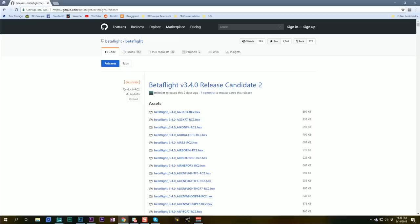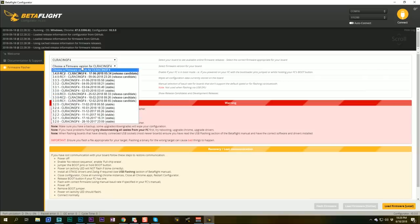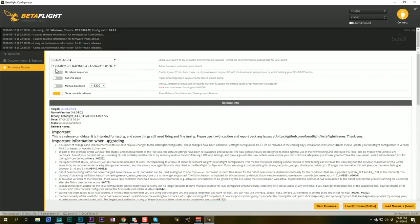The first thing you're going to need is BetaFlight 3.4. At the time of this video it is in release candidate — it hasn't been officially released. Release candidates are generally pretty safe to use. You're going to go into your BetaFlight configurator, go to the firmware flasher, check the 'show unstable releases' option, pick your firmware version, and flash BetaFlight 3.4 to your flight controller. There's another requirement: you need to be running either an F4 or an F7 flight controller. There wasn't enough program memory on the F3 and F1 boards to include this code, so if you're running an F3 or F1, you're just not going to be able to do this.